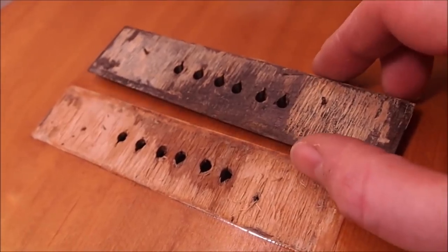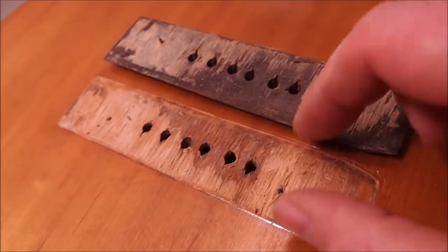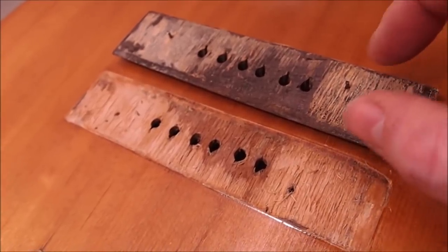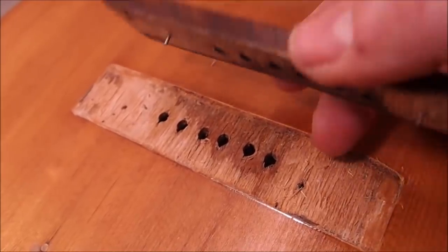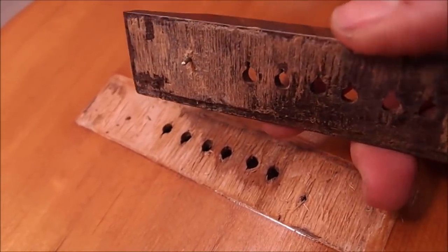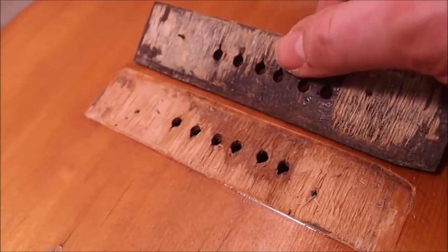So we learned some things. You'll recall in a previous video where I was working on the guitar that had the bridge inlay directly into the top — I ran a router bit into what I thought were metal pins. It turns out those are actually original to the guitar. These seem to be wire brads that he put in there and clipped off so that the bridge wouldn't move around when he was gluing it in position.